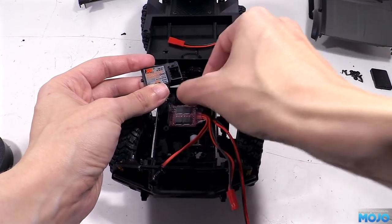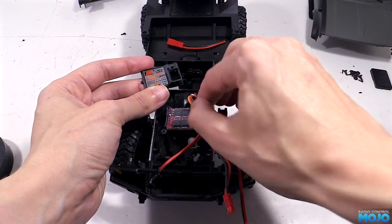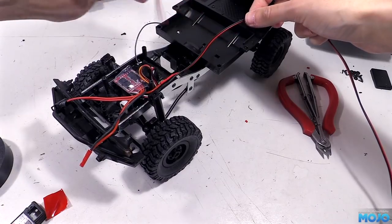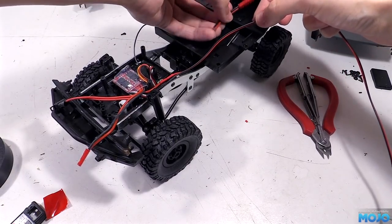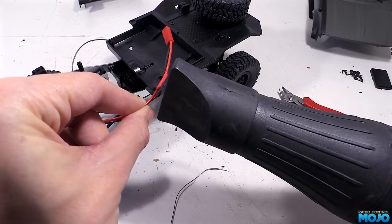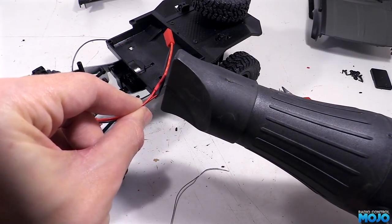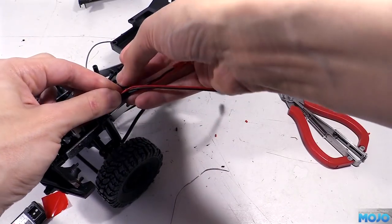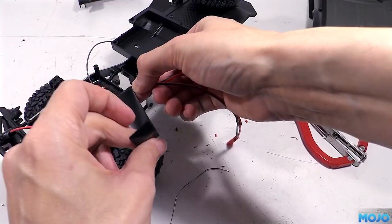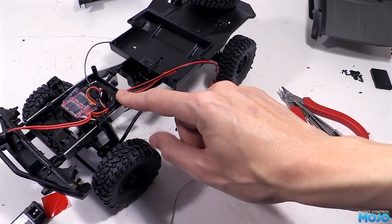Now that's all held in place, we can work on the other end of the battery lead. It's exactly the same procedure, just that this time we need to make sure the connector is nice and accessible through the toolbox lid when the cab all goes back together. I think we're also going to add a bit of tape around the motor and battery wires just at the end of the receiver. The mounting screw for the servo plate does stick out a bit, so we need to take some extra steps to protect things just in case they rub.